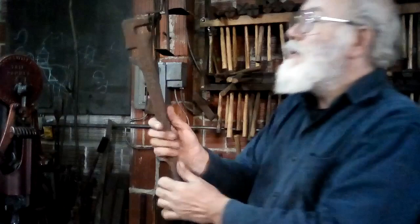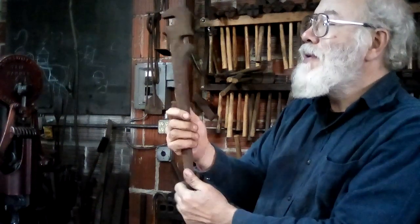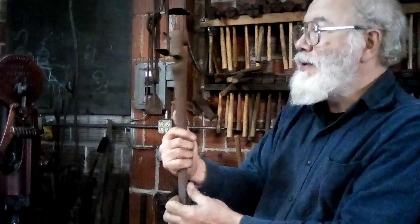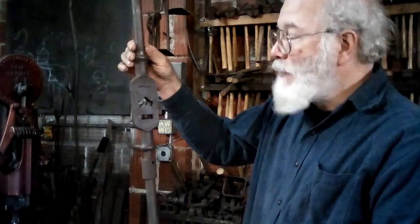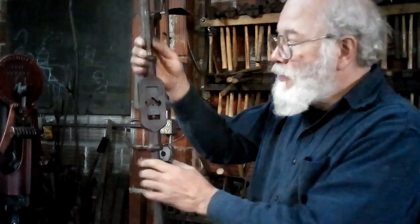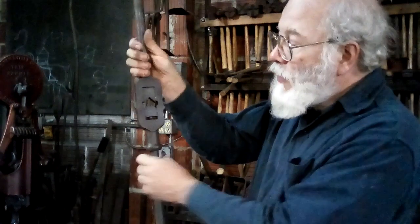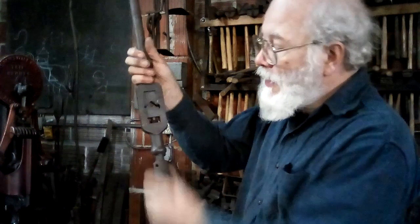Some people use these things, which are more like forks. They can be used as bending wrenches, or you can stick them in the vise. And the other thing that works really well is large-sized tap wrenches. If you can get a tap wrench that's big enough to put a 1-inch square in there, they are adjustable to grab taps, that works marvelously.